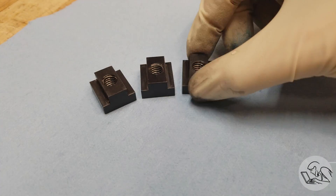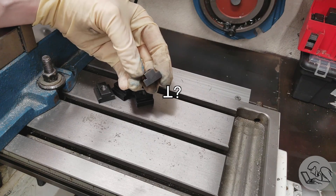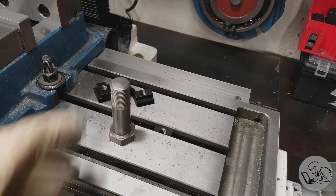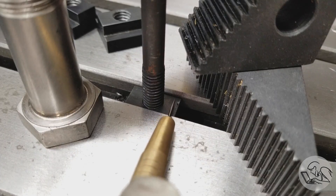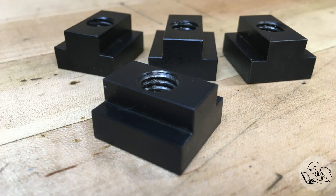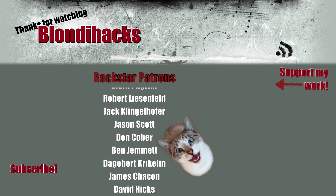The cold bluing has some corrosion resistance on its own, but the oil really seals the deal. Here are our final T-nuts — you do not have to make them this nice. I took the effort because it was fun, but these are utilitarian tools: rough mill them out of whatever you've got and they will function. Let's see these guys in action — they slide into the T-slots nice and easily. We can thread the hardware in, and the top of the nut remains below the surface of the table for proper clamping action. Because we distorted that final thread, the rod bottoms out and we can tighten the nut on top with no problem. I hope you'll try this as your first milling project — there are no tight tolerances, everything's very forgiving, and you get to make something that functions in your shop. Thank you very much for watching — consider supporting me on Patreon and we'll see you next time.